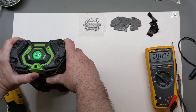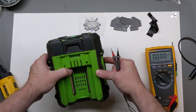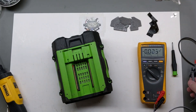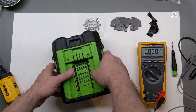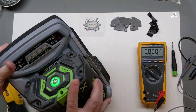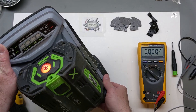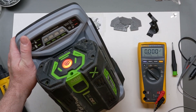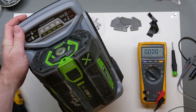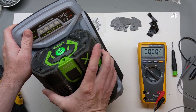This one shows green and stays green — it doesn't blink or anything. Checking voltage we're getting right at 50 volts, so it's not like all the cells are depleted. It shows like it thinks it's okay and ready to charge. However, when we put it in the charger, after the check it tries to kick in a high current charge and we get the 25% blinking red light. The battery still shows green.